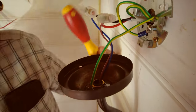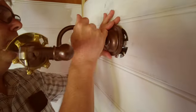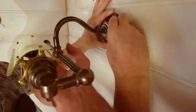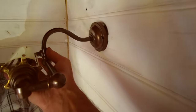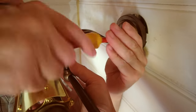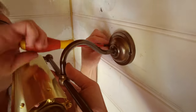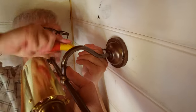Two self-tapper screws into the wall plate will carry the weight of this light. For heavier lights using this same system, you could use four screws, but you would just need to drill a little hole in the front of the canopy or cowl to get into the component part that we've made universal so it can take four screws. For this light it's not that heavy, so two screws should hold it fine.